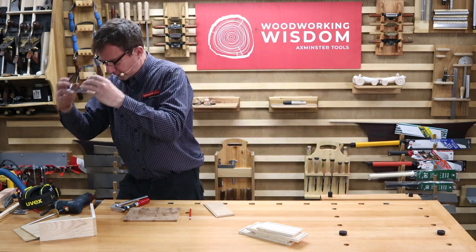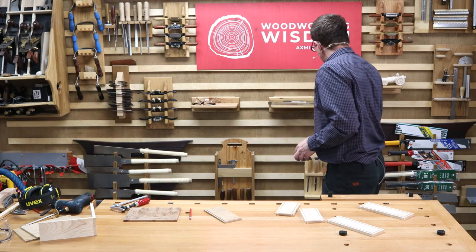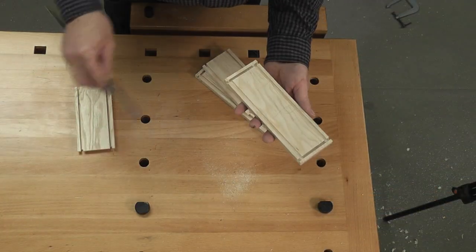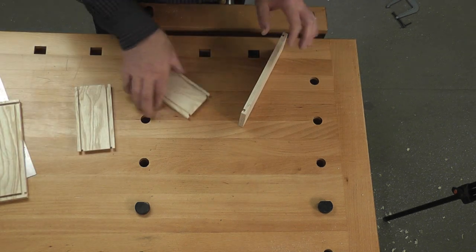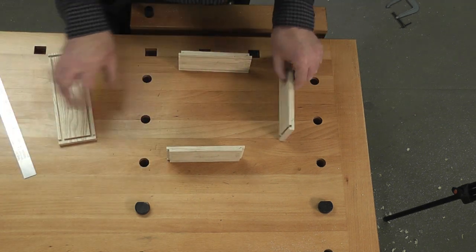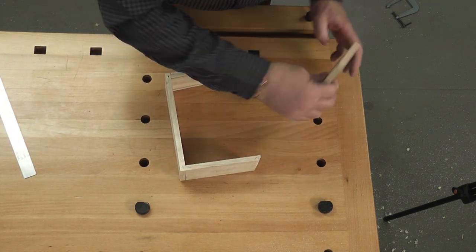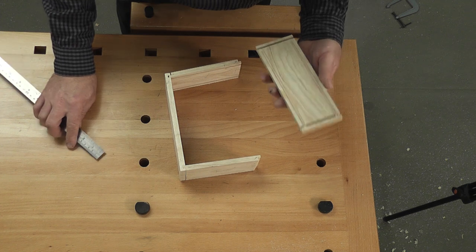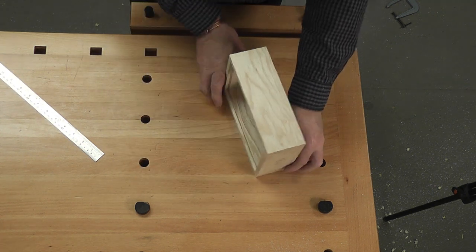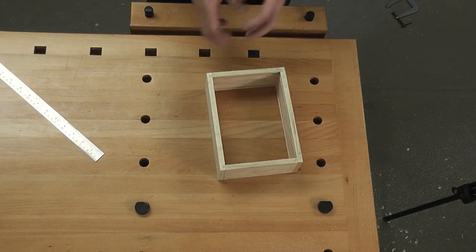Move a few things about. We have our four sides. Just one ruler needed. Got a little bit of fluff in this one — I'm just going to clean this out. We numbered our joints when we started, so let's find things again: one, two, three, four. Flip them over — the groove needs to go in and back. So now we have our groove running all the way around. Nice and parallel, and because of how we set that routing jig up, nice and equal. If you have a router table you can do it that way — I'm trying to take this right back to basics. Maybe you've just got a quarter-inch router. Now we need to get the measurement for the size of the panel.